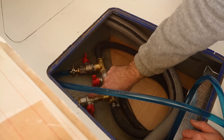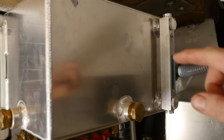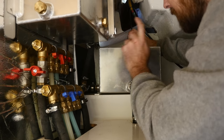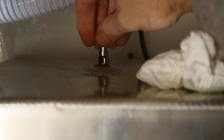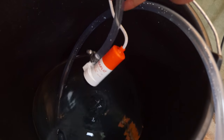I've turned off the pump and closed two of the valves, and now I'm opening the center valve to allow coolant to pass through the system when I turn on the heater. There's plenty of coolant in the expansion tank but there was quite a bit of air trapped in the buffer tank — which makes sense since both connections come in at the bottom. I used the little pump to top off the expansion tank, and now there should be no more air in the buffer tank. When I turn the bleed key up top, only a little bit of coolant comes out.